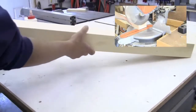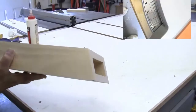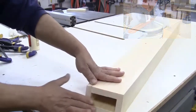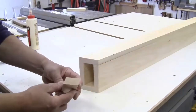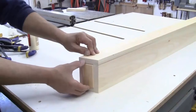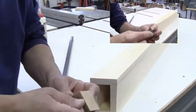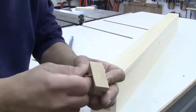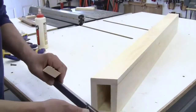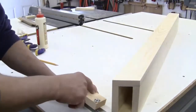I've completed the glue up and I've trimmed down this end so that it's nice and flat. I've trimmed down the bottom end so that it's at a 20-degree angle. Now I'm going to prepare a piece to go in here that's flush with that 20-degree angle. I've prepared the piece — as you can see it has a 20-degree angle on either side, and when I place it in the hole it remains parallel to the 20-degree cut. I'm going to use a T-nut. With the T-nuts mounted on the back you can see how the machine screw goes in and screws right into that T-nut. Now I'm going to prepare the rod by drilling holes so that the machine screw can go through and screw into the T-nut, by centering this piece on the rod and drilling the appropriate holes through it.